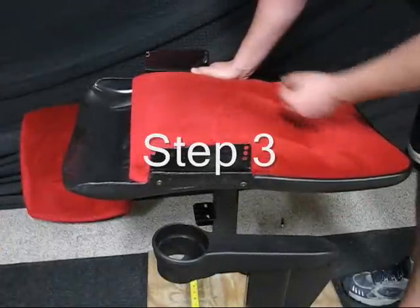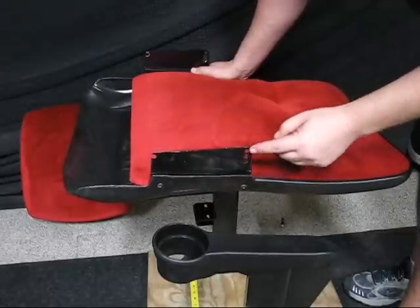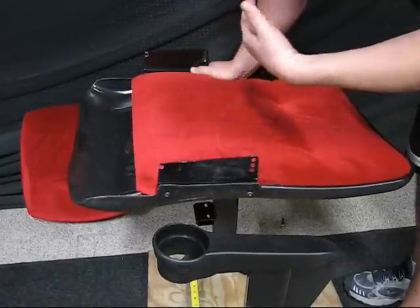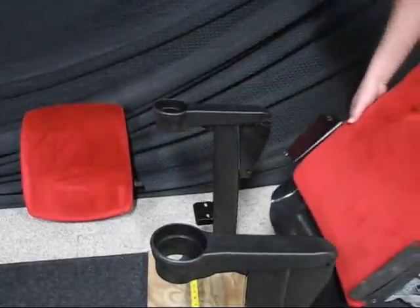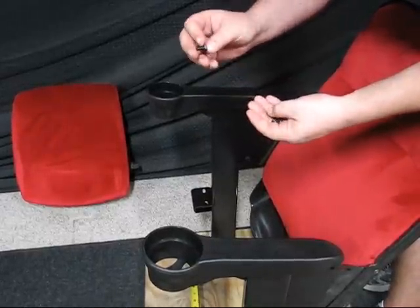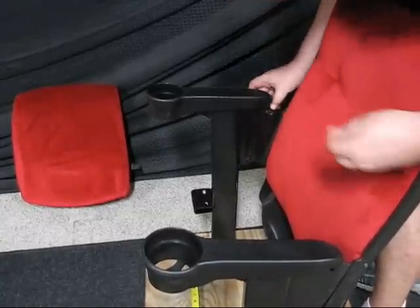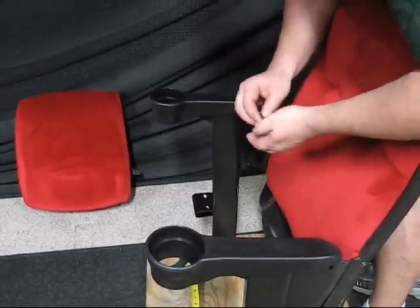Our Ruby Marquis — this is a 21-inch back. Here's the ear we're going to use to mount to the leg. You have a slotted end at the bottom and three holes at the top. We recommend using the center hole as your mounting area. You can use the front or back hole depending on whether you want a relaxed or more upright position, depending on your comfort level. Take your back and slide it on your ears at the bottom. Then take your back bolt and nut and stick it through the center hole, put the nut on, and follow the same step on the other side.